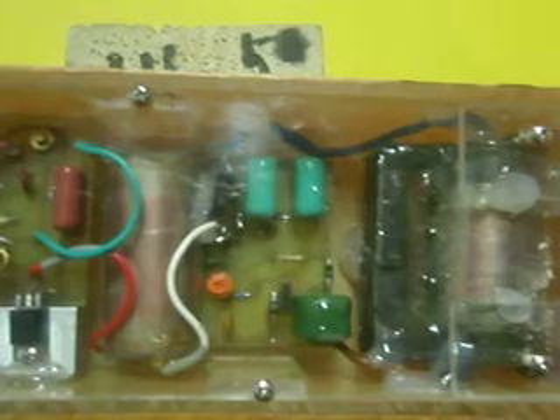The output capacitors affect the voltage wave between the caps. The greater the output capacitor, the more energy will be stored, so the more powerful the discharge will be. But a larger capacitor gives bigger sparks, it requires more charging time and gives a lower discharge rate. On the other hand, smaller capacitors give smaller sparks but a faster discharge rate.